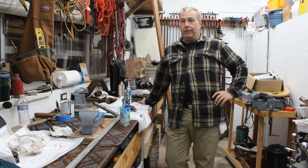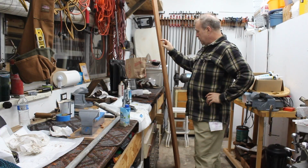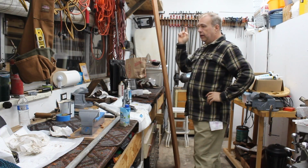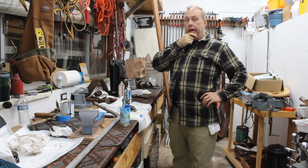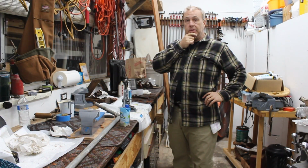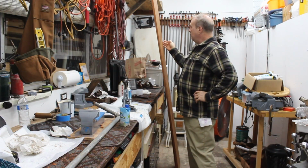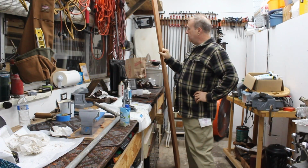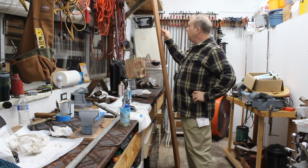We're continuing on with the Mahogany Buffet project. I took the planks out of here and into the wood shop next door, which is kind of an outdoor space up here, and I ran them through the table saw, and then trued up the opposite side with the hand plane surface. And so now the planks are straight and true.